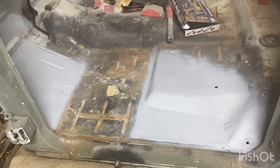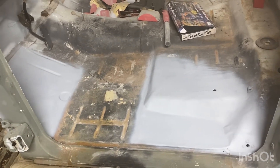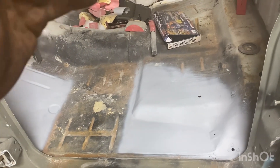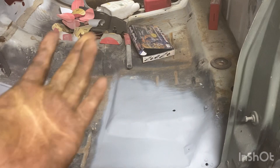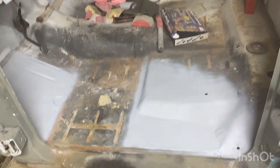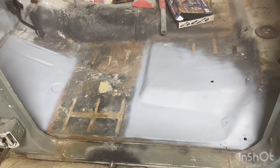When you do a car floor pan, or really anything - it doesn't matter if it's a floor pan or a quarter - butt weld it. Don't put a lip on it and weld over it. Just butt weld it. That way it's nice, that way it looks like factory. Because Barry's floors in that blue Mustang - I guarantee from the underside you could tell exactly where they were put in. Eventually you want this stuff to not look like it was ever put in.